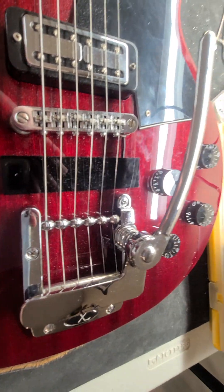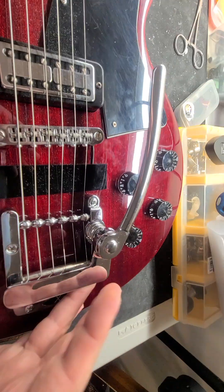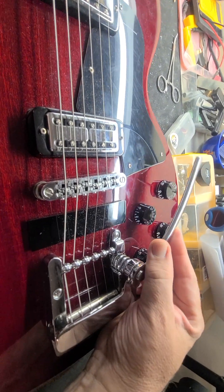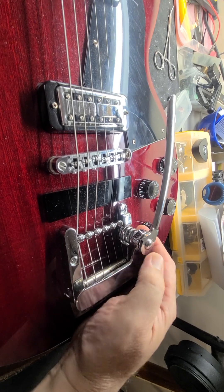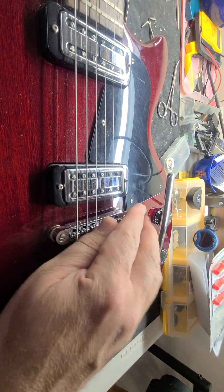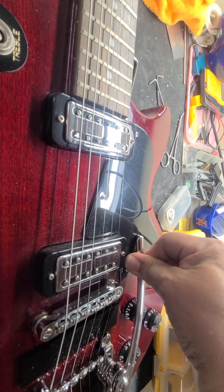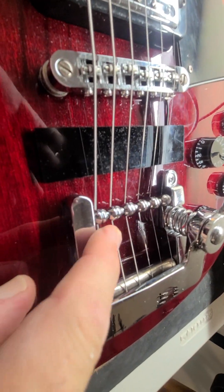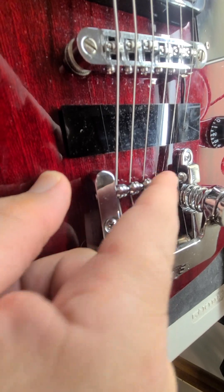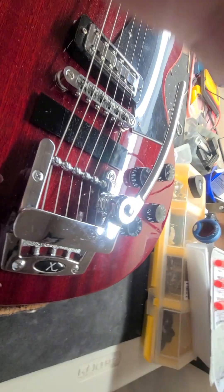Which was stupid because I should have just drilled through and put it in there — but me not so smart 15 years ago whenever I did that. This is a pretty good design. It doesn't have a lot of throw. It's got kind of a stubby arm — came with two springs, one weak and one stronger. This is the stronger of the two. If you notice there's not a lot of room here, it kind of bottoms out real fast. But it's got rollers here, just on a post, and you keep those oiled — that's not too bad, and they keep it spaced well.